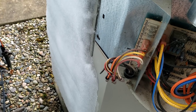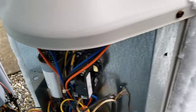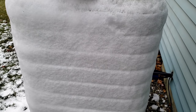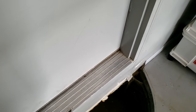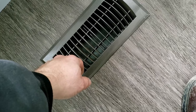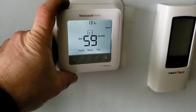Not sure why it was running that quick and the fan's not running — could be because of this jumped thing. Look at that, it's instantaneous. I'm curious — let's turn the thermostat off and see if this thing shuts off. Maybe we've got a fan motor issue because the house is really cold. I wouldn't figure the fan not running would cause our outdoor unit to freeze up. Okay, the fan is running now — I'm curious why it didn't come on as fast as the compressor did.